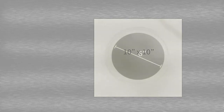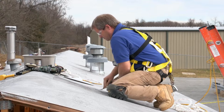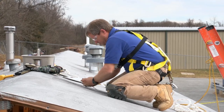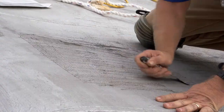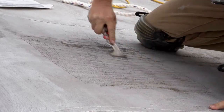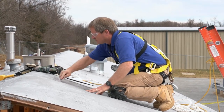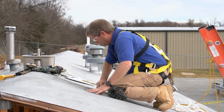After the hole locations are marked, a sheet metal patch can be cut into a 10-inch by 10-inch square. This square can be used to find center and ensure 2-inch coverage beyond the edges of each patching layer. Once the hole center locations are marked, the hole cutting can commence. Scraping the surface of the roof may not be necessary if the roof coating is in good condition. However, if the roof coating is peeling or rusting, scraping the surface can ensure that the patching material will bond successfully.